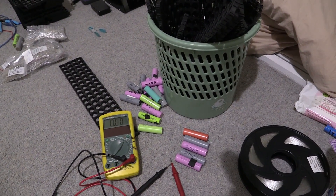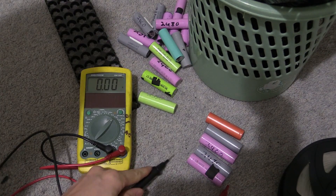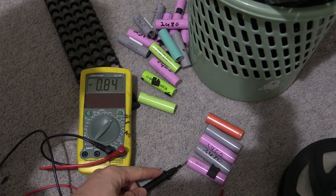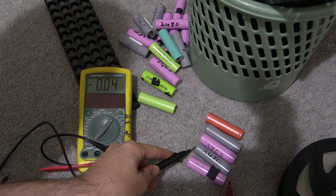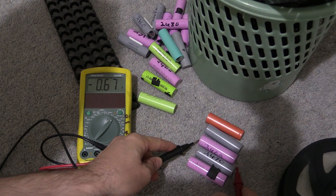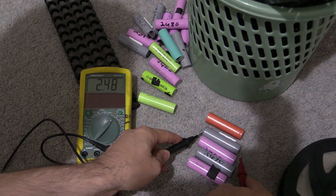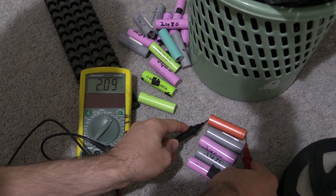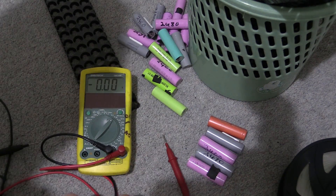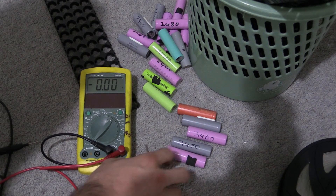Let me bring the multimeter out and quickly show you. If I show you these, you'll see how low the voltage has dropped. First one: 0.84 volts. Next one: 2.5 volts — that's dropped quite substantially from three volts. Another one: two volts. We don't really need to test them all, but that just shows you that these ones were definitely the worst, and it really does show you how important this process is.